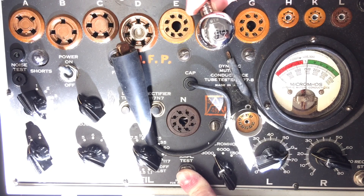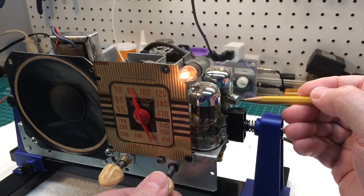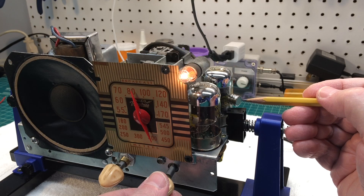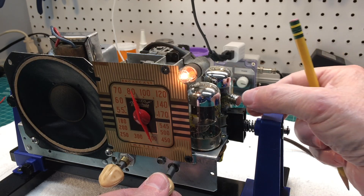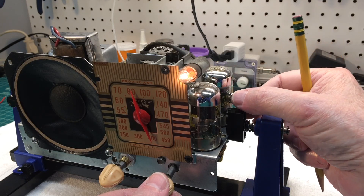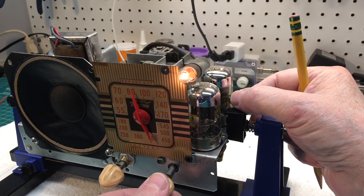Let's take this over to the PT-25 and try it out. As you can see here at my pencil, I've placed three of the small magnets on the tube. Doing the math, that gives me about a 30% reduction in gain for the 7B7. You can see how the placement in the magnetic field alters the gain of the tube.